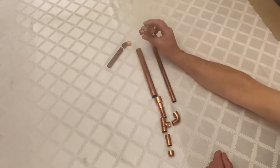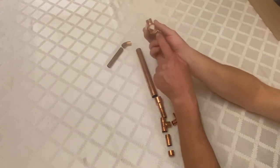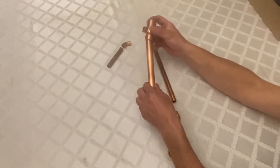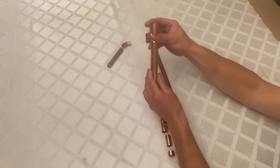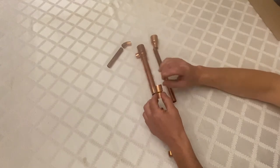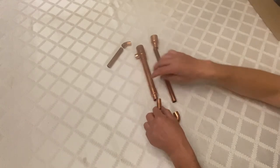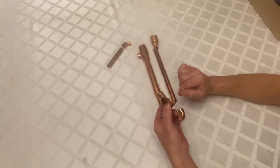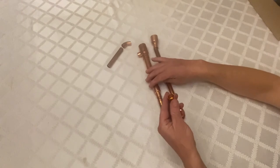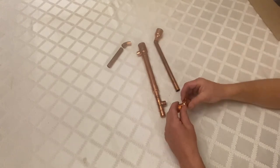On the top you're going to have the most expensive part, which is a three-way coupling — this coupling is one inch by three-quarters by a half. There's going to be a little lip in here that you're going to have to grind out with a Dremel tool or file out. You're going to put this together so that the top is pretty much even or slightly below the top lip of your three-way coupling. Below it you're going to use a three-quarter by half inch reducer, a piece of half inch copper pipe, a half inch copper tee, another piece of half inch copper pipe, and a half inch end cap.